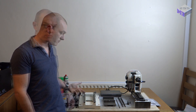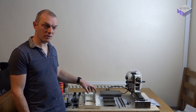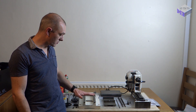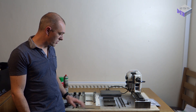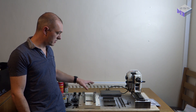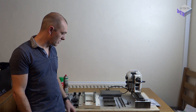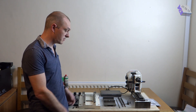Hi, so the next step after doing the CAD element is to put together my milling machine and then machine out all the aluminium parts to make the Y-axis and the X-axis travel with CNC. I'm going to do the Y-axis first, test it to make sure it's all good, set it all up, and then cut out the parts for the X-axis and set that one up as well. I'll go through a quick setup of the milling machine and then start machining out some of the parts.